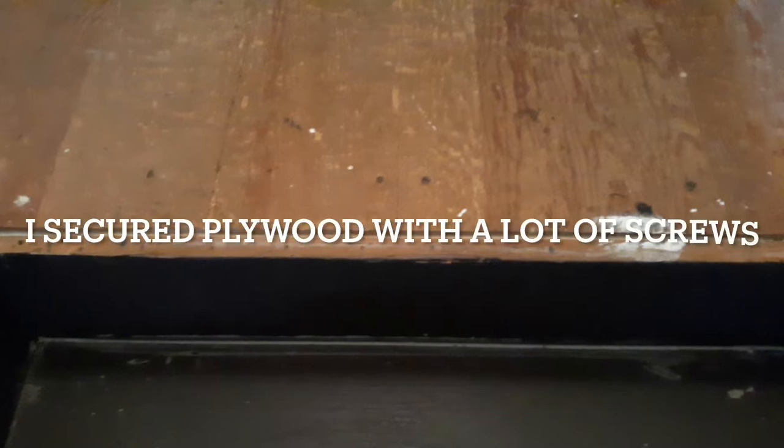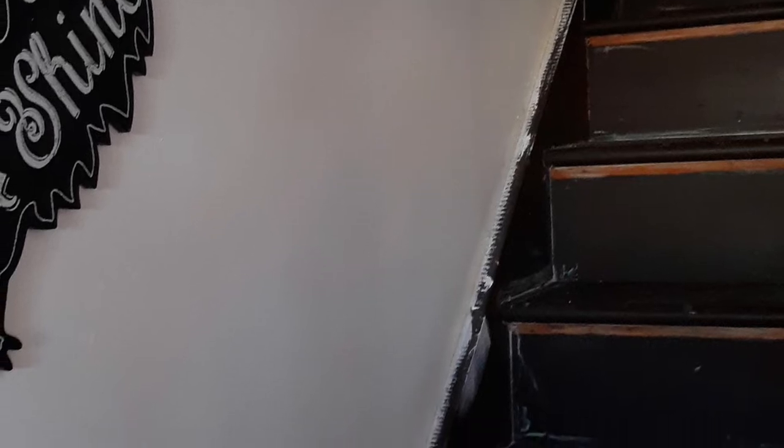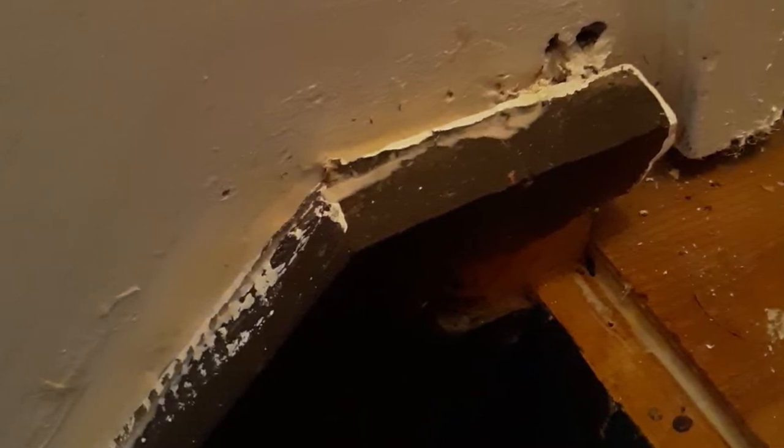I located the moving spots with the risers. I don't have a finished floor on the top of the stairs, as you see. But I screwed everything in there and made sure that was secure so it didn't squeak. There's no trim coming down here. I had to sheetrock and mud up all the holes. I have a little crack there, but I know I'm going to do some trim over that little hole. You can see the newer plaster I put up there. I will paint all that and then trim that out later.